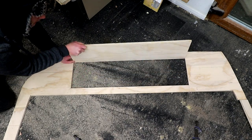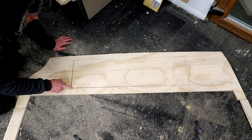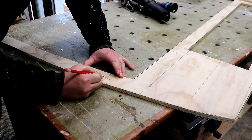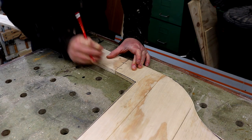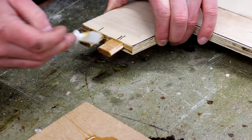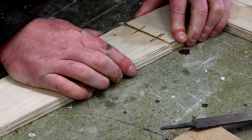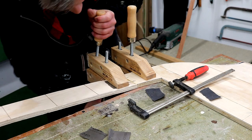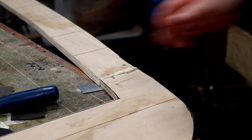On the top panel we cut out what will be a cupboard door, simply cut out with the track saw giving us a 1.6mm gap all the way around — the kerf of the blade — with the corner cuts finished using a Japanese pull saw. I marked up where to add some dominoes; there was only space for one on the right hand leg but the left was a little wider so I fitted two. I used 8mm dominoes with polyurethane glue mainly for the fast set time. Clamping this shape was always going to be a challenge but using sandpaper under hand screw clamps with F clamps to squeeze from both top and bottom worked okay.